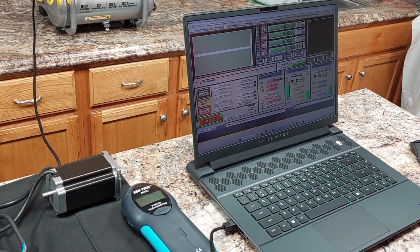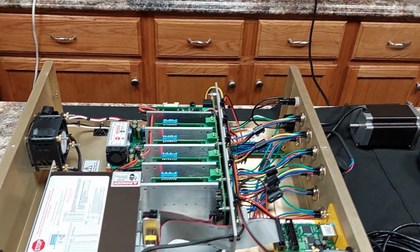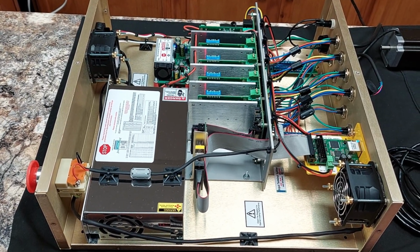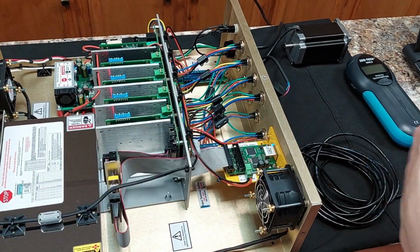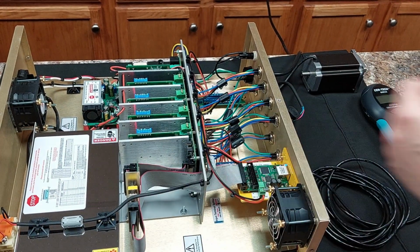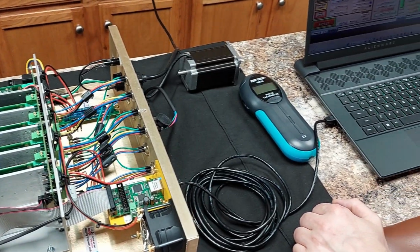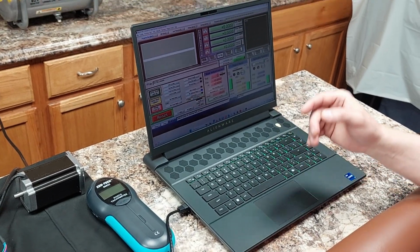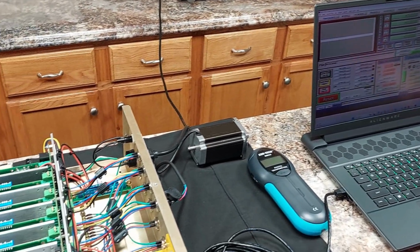Okay? Now, once again, once this unit is fully completed, again, I'll do a follow-up video as everything is coming to fruition. But seeing the system now and what you can expect out of a stepper-based system, and once again, guys, I'm only running 1/10 microstepping or 10-time microstepping. Okay, so we can go up to 256. I have it set at what a G540 would be. And I can tell you, I have never in my life of working with automation ever seen a stepper achieve that kind of RPM. That is amazing. Let alone doing it at 50 volts.